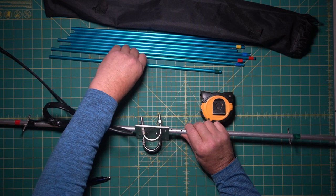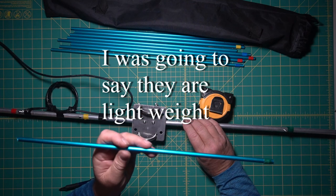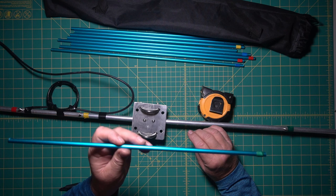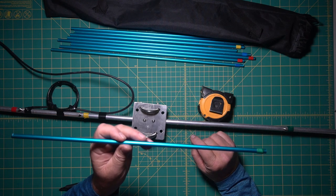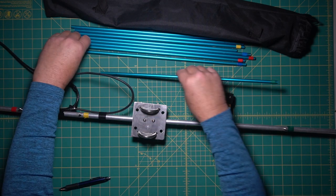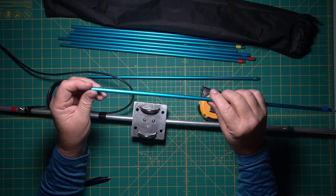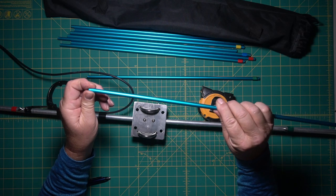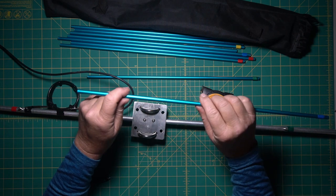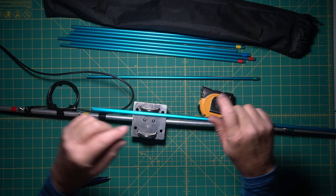I'll tell you what, these arrows, I'm going to go ahead and link the same ones that Adam linked in his, and the inserts and stuff, and that's the way to go. When you do put the inserts in, like he said, you want to make sure that you get the anodizing off the inside of these to make sure it makes continuity. Check your continuity, make sure you're making continuity to the inserts so that when you screw them together through the threads, it makes one long one.